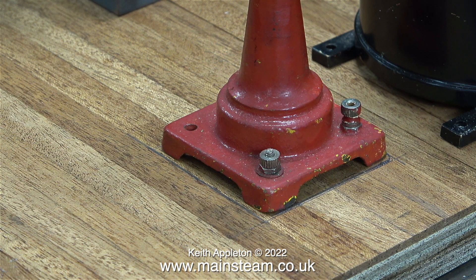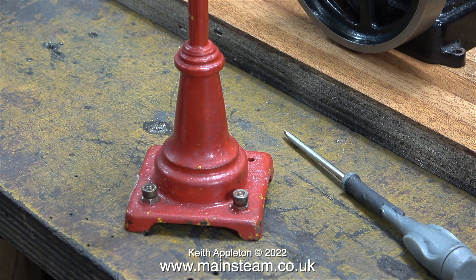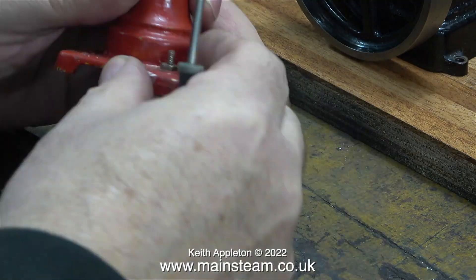I'm a bit puzzled why the positions of the holes in the bases of these lamps are in such strange positions relative to each other. Have a close look at the positions of the electrical connectors - the weird position of the holes is really jumping out at me. I'm also going to remove the electrical connectors; all of the wiring will be hidden underneath the baseboard. I propose to remove the connectors, take a good long look at the positions of the holes, then change the position of the holes before drilling them a slightly larger size.